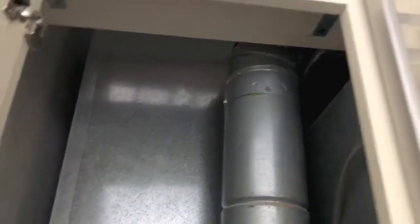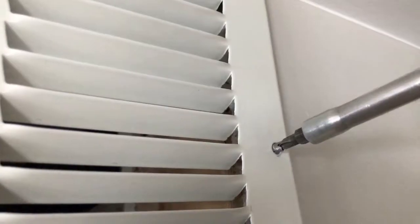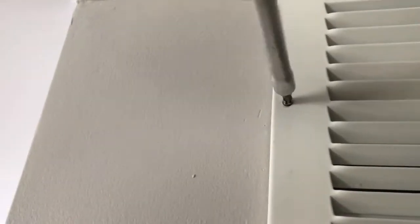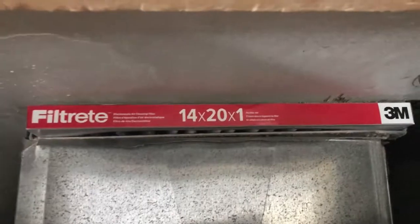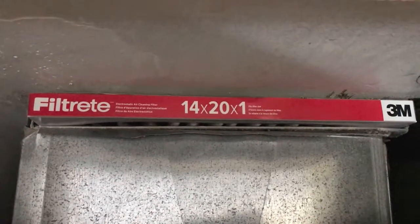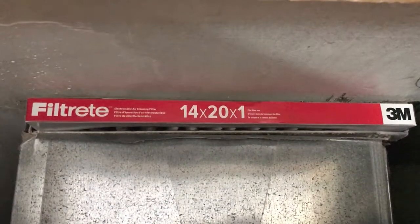As far as the location of our furnace and filter, we have a very unique location. The top portion goes up throughout the entire ductwork and the filter is in there. We'll grab a Phillips screwdriver and remove that vent cover. Right inside there at the very top is the filter. It's also important to take note of the actual position that the old filter is in, because most filters are designed to have airflow travel through them in a very specific direction.